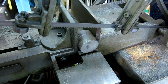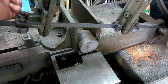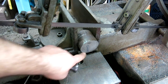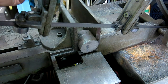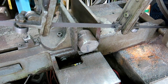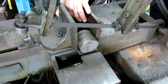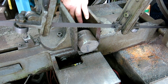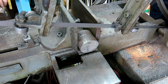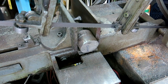So if we wanted to slice off a piece of this little stump here, you're really pre-loading one side of the vise, and as you tighten the screw that jaw is going to want to rotate — this is where you want a packing block. It's a weird size, two and three-quarters, so I use these stair-step jacks for this kind of thing. I'll open this up and set it in here, pre-loading that jaw a little bit so it doesn't move, and then crank down on the main handle. There we go — that's solid.